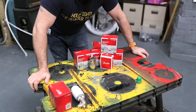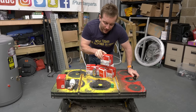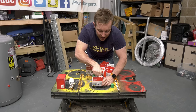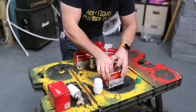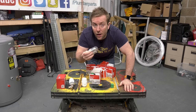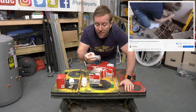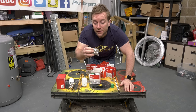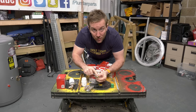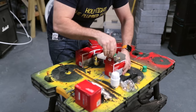So what do you get inside the box when you buy one of these RAS-B2 Dynamic Radiator Packs? You've got quite a bit in here — this has got the lock shield and the TRV. We've got a standard Danfoss TRV head, a set of tails with little nicks so your PTFE or Loctite doesn't slip, and a lock shield with a little hand key. We're going to leave every one of these fully open, which just feels foreign, but you've got to get used to it. Then we've got our TRV body, updated and ready for the balancing.